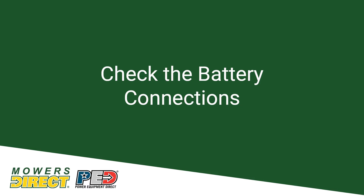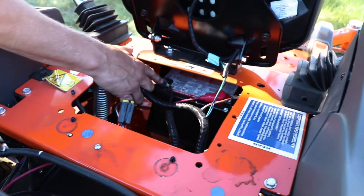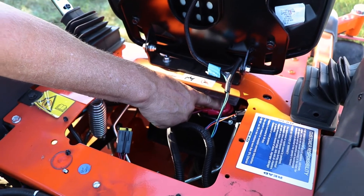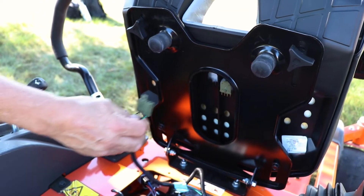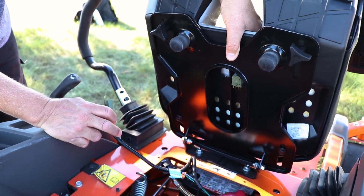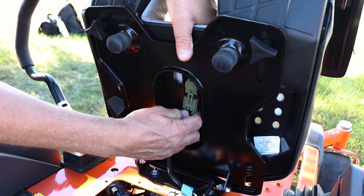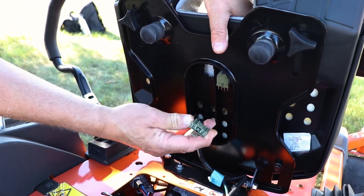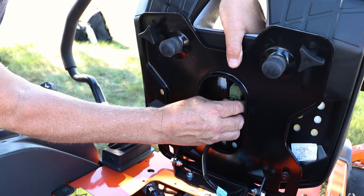You have two battery connections here. This battery is going to have to be connected — it's not connected when it's shipped. So you need to put the negative on the negative post and the positive on the positive post. Also, the seat switch here is going to be disconnected. What this switch does is it's a presence switch, so you have to be sitting on the seat. It has to sense your weight for the mower to start and run. Should you fall off the mower, it would cut the motor and the mower would stop. This is disconnected when you get it, so you have to make sure that you plug it in and lock it into place.